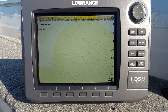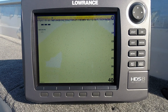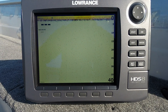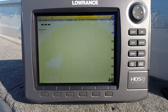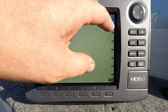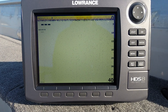The first thing you're going to want to do is take a look at the top bar. If you're getting surface clutter, that'll generally indicate that the unit is still sending a signal out. If you're not getting anything like that, or just a very thin yellow line at the top, chances are that's a problem with the unit and not the transducer — though it still could be the transducer. In this case we have surface clutter, so I'm leaning towards a transducer issue.